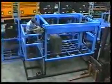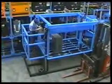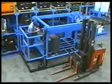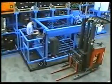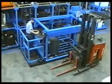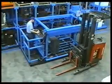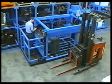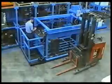The system shown here utilizes a double stacked multi shifter system changing the batteries in a reach truck. As we can see, batteries are stored adjacent to each other in the double stacked roller stands with the appropriate chargers mounted above. This portion of the system allows the space for proper charging and cooling of the batteries prior to their use in the lift trucks.